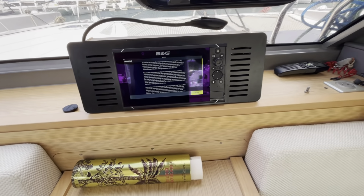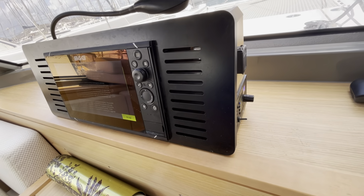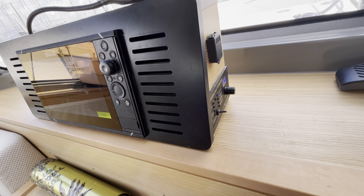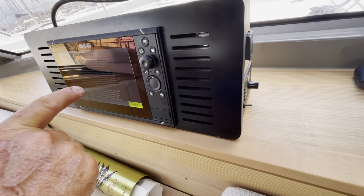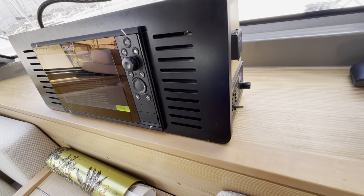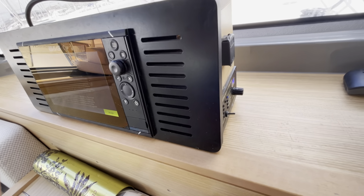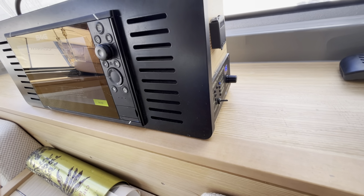Have you ever seen the low battery or temperature warning light for them? Never seen temperature. Have seen low battery. Okay, and overload probably, when you're charging too much? I don't think so. We've seen an overload signal on here, which I'll talk you through in a second. But this is the current limit, so it's my maximum of 16 amps. Is that 16 volts for shore power? 16 amps. Yeah, I see. Is that a knob? Yes, you can adjust it. You've never touched it. You leave it on 16 all the time. Yes.